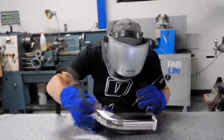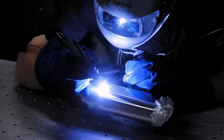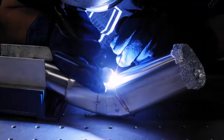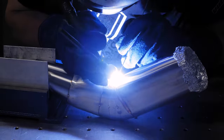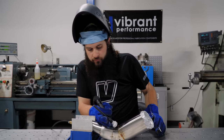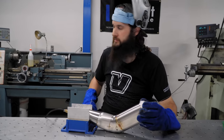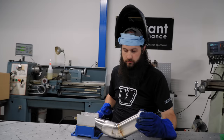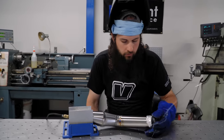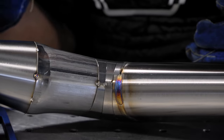Lots of argon. We're going to weld. When you finish your little section of weld, try to let the gas coverage flow for a few seconds. This machine is, I think, automatic. But if you tap the pedal, sometimes it'll make it go longer and then you'll reduce the color because you've got the argon covering the hot material.